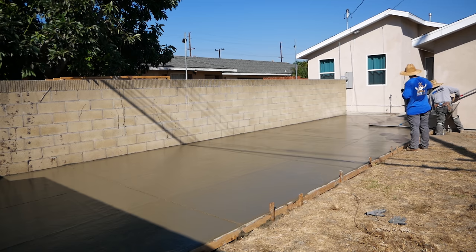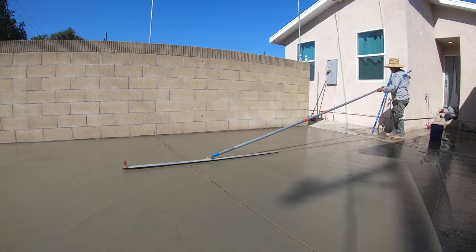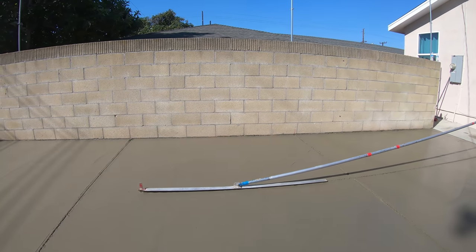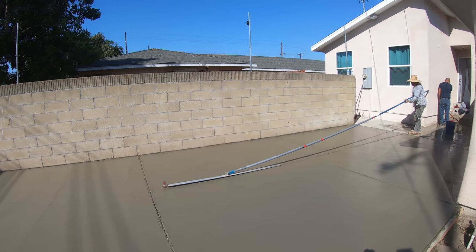First we're going to go with a deep cutter, which cuts down about 2.5 inches, so you get a good break in the aggregate. And then we're going to follow up on that with a 3/4 deep half inch radius joiner. That'll be your finished product.